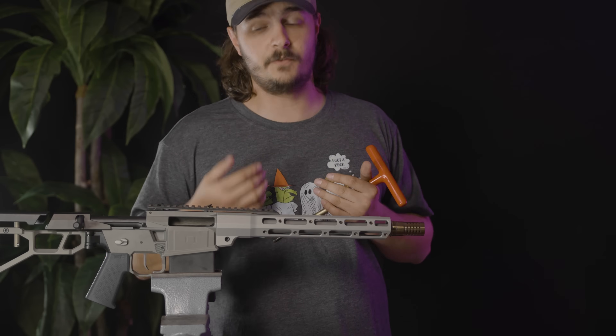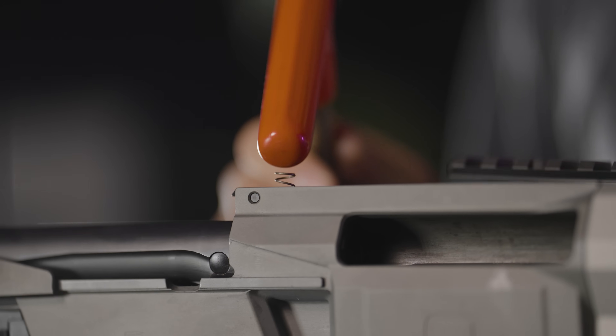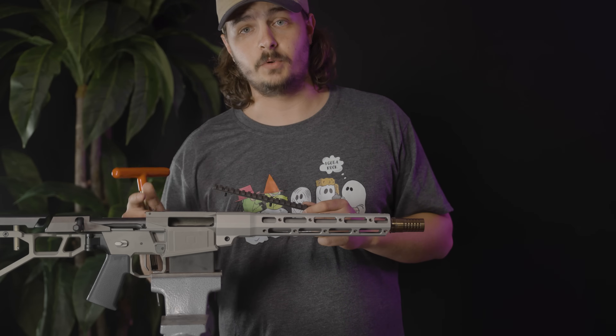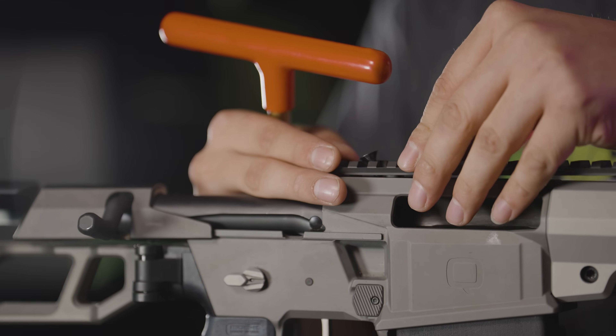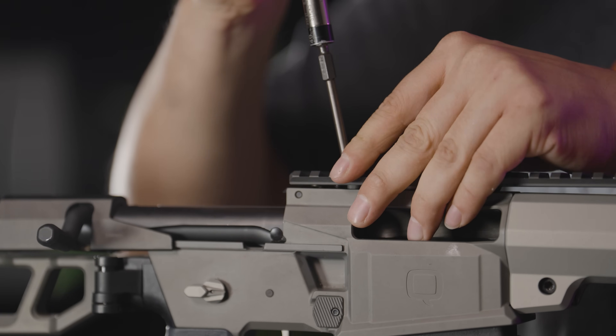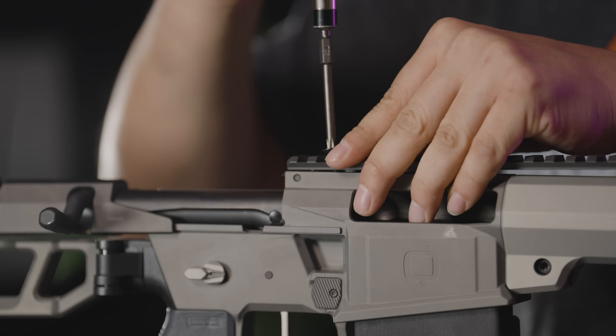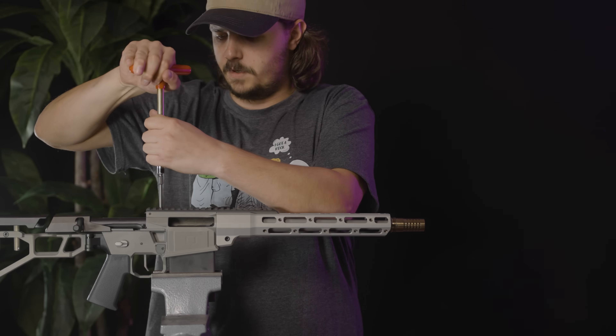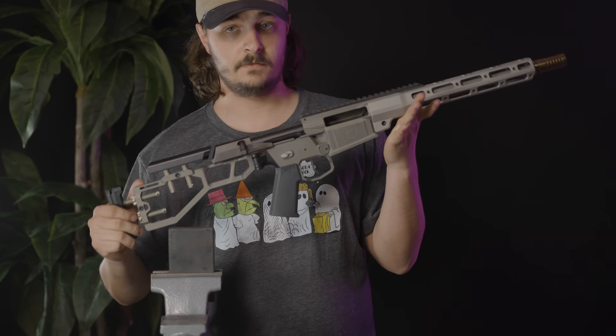The only thing that's a little different is the 40 inch-pound pinch for the barrel that we did earlier. You'll notice a spring right here — we're going to use the top rail to compress that, and that's your bolt stop. Compress the spring down and start from the rear. Torque to 50 inch-pounds. Super easy, super simple. Now I've got myself an 8.6 SPR. And that's how.